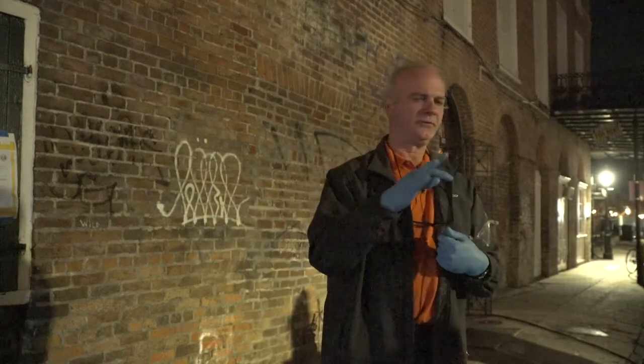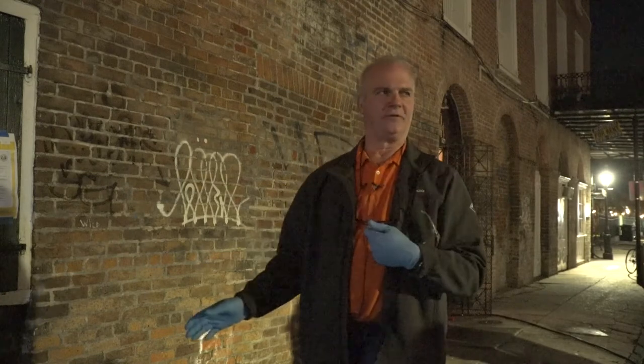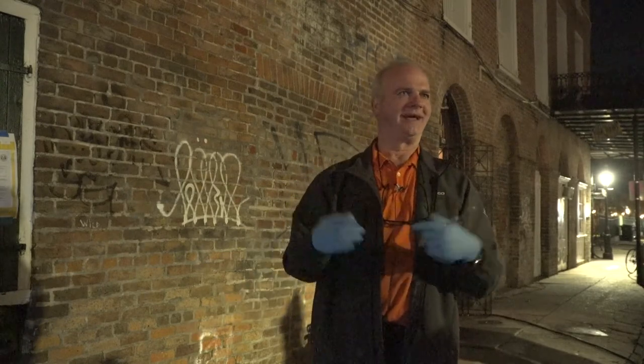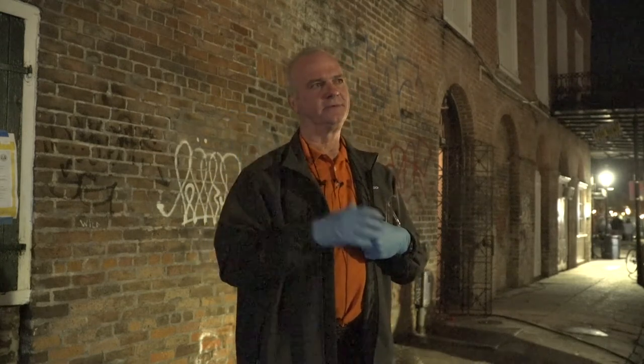But you can for sure go to a little stronger stripper. We did it with the Vucre. We went with a little stronger stripper over this and we took everything off, but we had to have an hour dwell time, and that didn't fit in with our twilight workshop. That's why I use this one, but I think this one would be fine most of the time, and with hot water. So you see that equipment makes a difference. Y'all can't get graffiti off with a water hose, a can of aerosol graffiti wipe, and a stiff brush. All you're gonna do is break it down, smear it around, and it's just gonna suck back in.